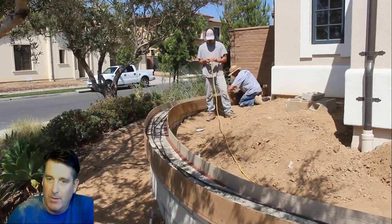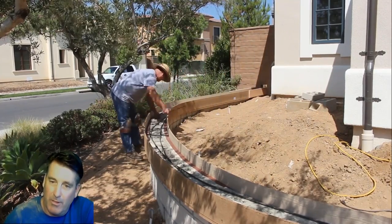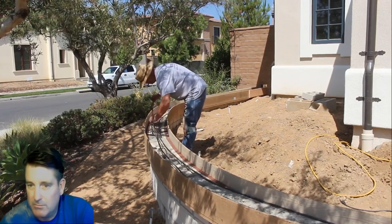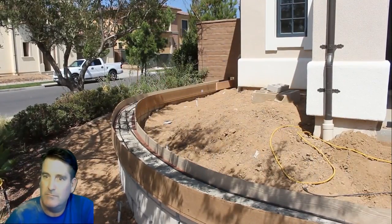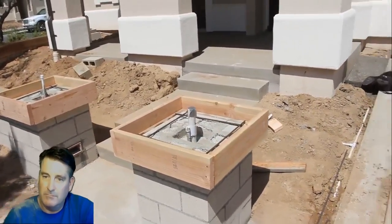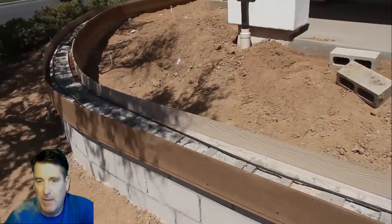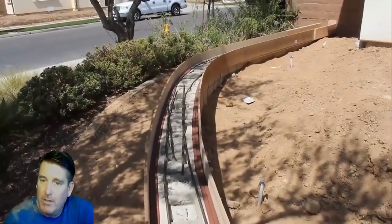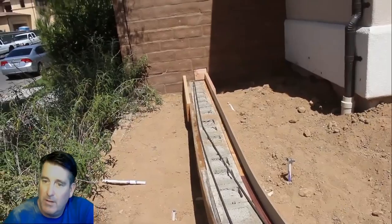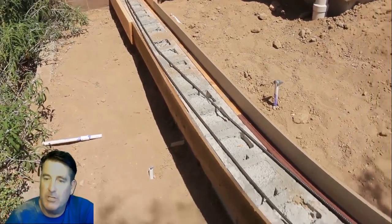Here's the rebar going in, and there's your siding that you'd probably see on the outside of a building. I just use whatever works or whatever is available. You can see how we recessed that initial grout a little bit down. Before we start putting the concrete in, I'll wet the top of this block a little bit so it'll adhere better and won't flash-dry on me — buys me a little more time on the finishing end.